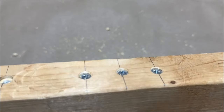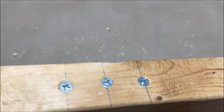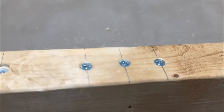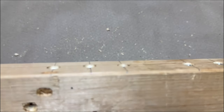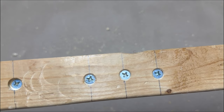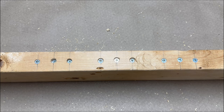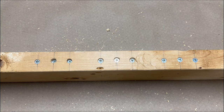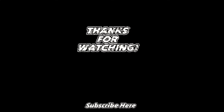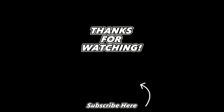If I wanted it to be flush, I could adjust the stop itself and bring the screw head up a little bit. But right out of the box, that's what it did — perfect. It made a perfect hole. There's no tear out — well, that one has a little bit of tear out, but they're all pretty similar in that regard. It made perfectly round holes and those screws fit perfect. If you're looking for a one-step process to countersink your screws, this didn't mar the wood at all. I think it's a perfect solution. I hope this helped you make a decision. Thanks for watching. We'll see you next time.